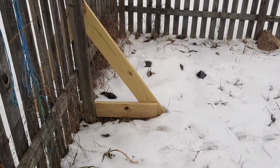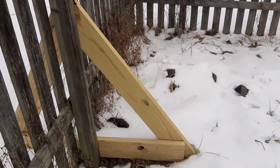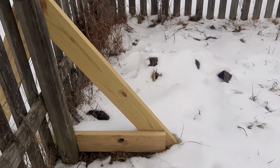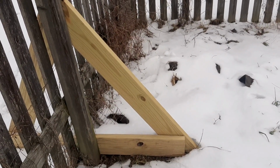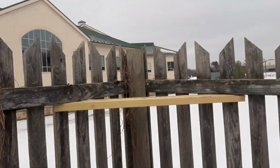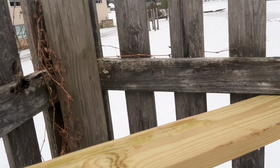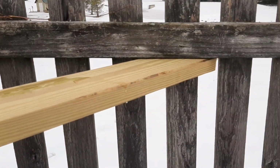I'll show you what I did to the corners and what we could do for the rest of the corners in a minute. So now I'm on the inside, so you can see the inside view of this. Again, I did this rather quickly when I was up here, so I'm not suggesting this is exactly how it should be done. It could be done a little more neatly, and I would do it if I had a whole day to take care of this. I just wanted to do a quick prototype. So that's that there, and then the corners. I braced the corners. You can see I basically put a piece between the 2 rails on opposite sides, and we should do this. I really made this side stiff. Made a little triangle here, and nothing's going anywhere now because of that. So we should do that on all 4 sides.